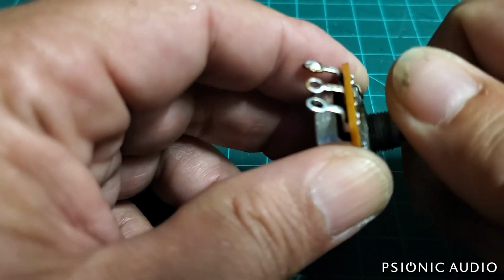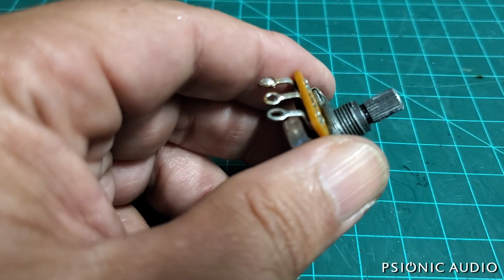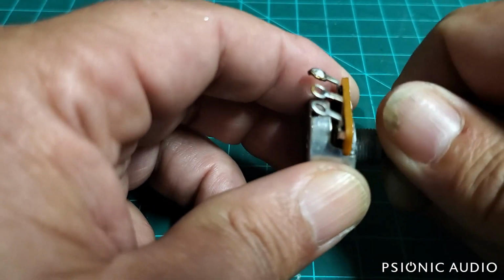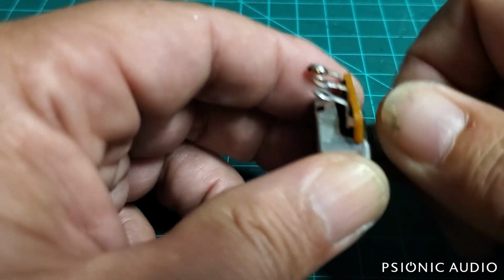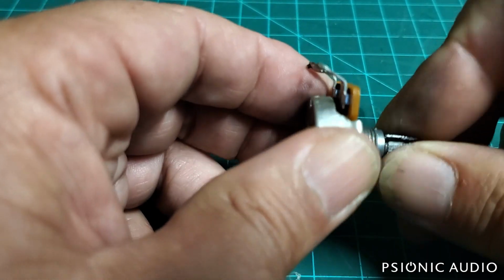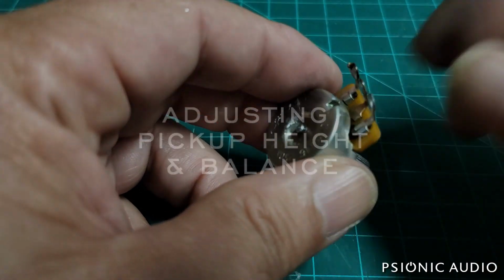Sometimes it's best to buy a pot that specifically has low tension. I know Van Halen and Electro-Harmonix market one, and I know the Emersons come that way. And there's variation in the stock tension that pots have. This is a fairly cheap one that was very stiff. Most of the CTS 30% taper ones on the market are pretty darn good. Anyway, that's how you adjust that.